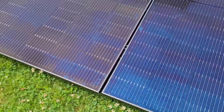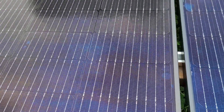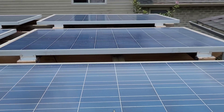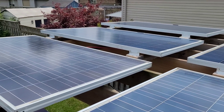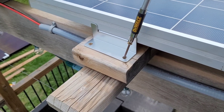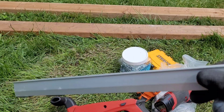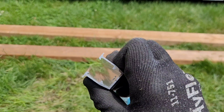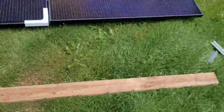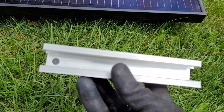The mini rails are about 13 inches long and go at the joints of the panel — they don't run the full length of the 2x4. Back when I installed the old panels I went with cheap, simple Amazon solar panel mounting brackets, but today we're upgrading to mini rails and clamps, which make things easier to service and move around. These are a 13 inch aluminum rail from Signature Solar — I'll put a link below. I'm cutting some in half with the bandsaw just for the ends.